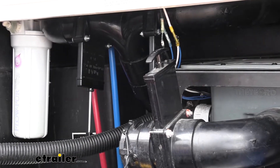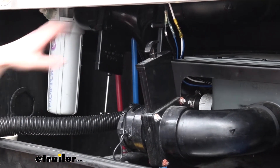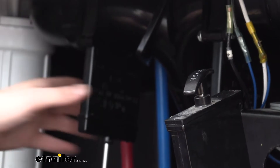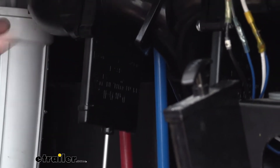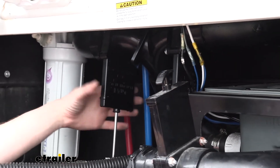That way we can be working more towards the outside. We're going to remove the rest of our bolts the same way we removed those inner ones. You can see here that the collar on one side we can slide back, but on the other side this collar is fixed in position. That means we're not going to be able to change the angle other than the set places that the holes line up. We were maybe going to try to make them a little bit easier to pull, but if it's glued you just can't move it — we'll have to leave it how it is.